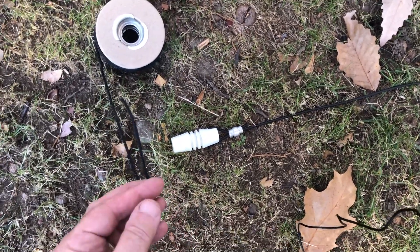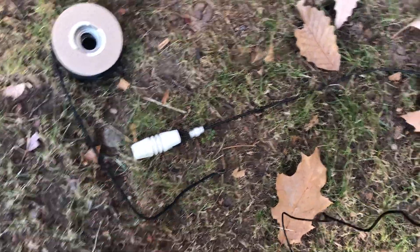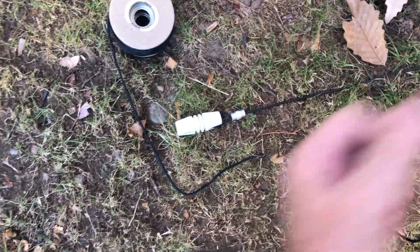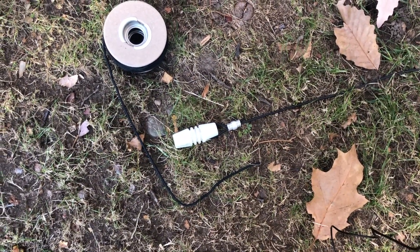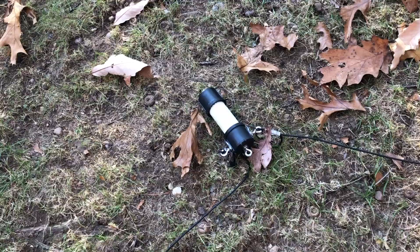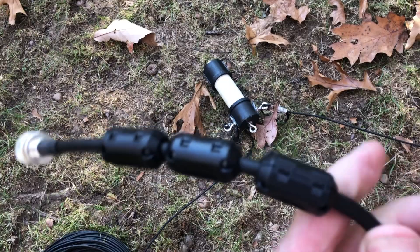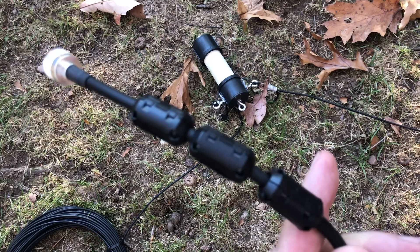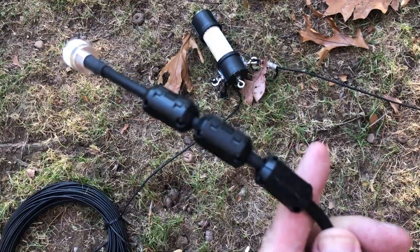Here's some Dacron antenna line I got from Quicksilver Radio. This is the short end of the off-center fed — I want to keep it to this side of the installation because the shack is closest to here. The first thing I'm going to do is stretch the antenna out and attach the coax cable. On an off-center fed you do have a balun hanging in the middle, but you also want to put just a handful of snap-on ferrites on your coax cable to choke some of the RF that might be coming back down the shield. I had these three in the junk drawer, so hopefully that's enough.